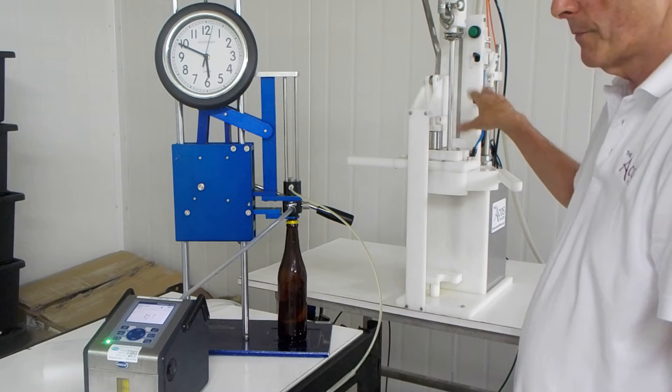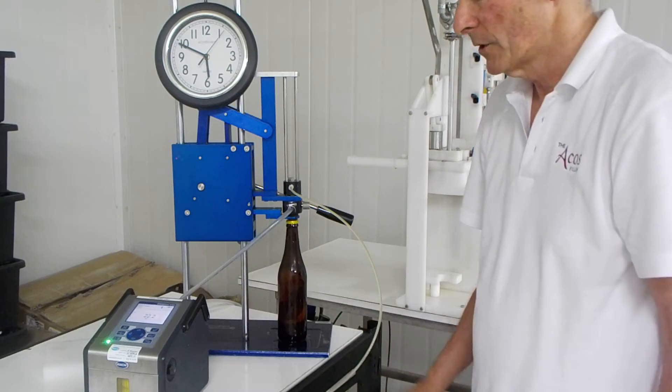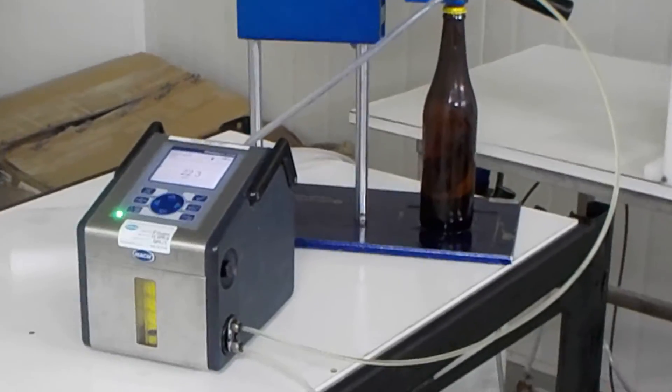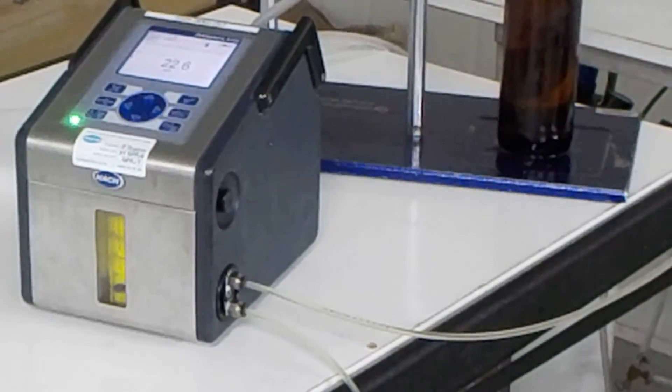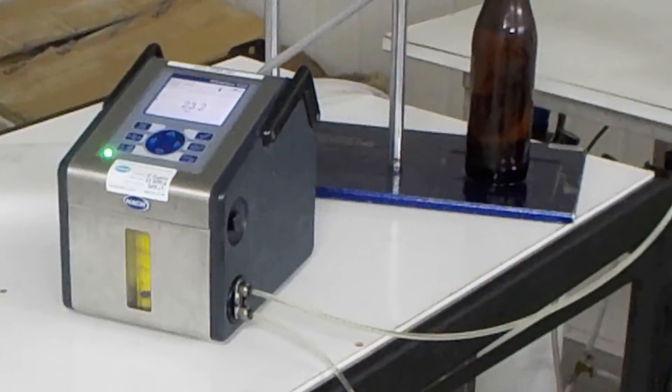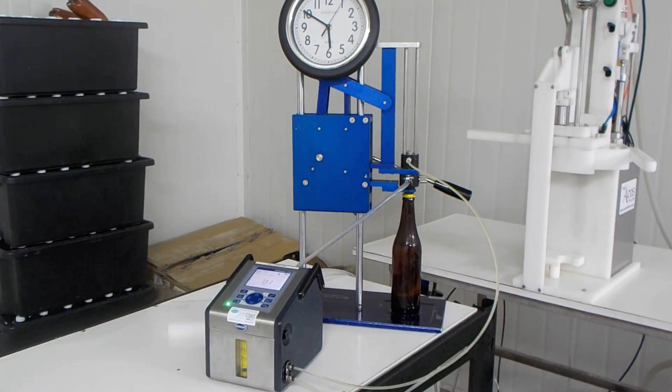This time I only did it without the purge and it's currently running at about 22.2. I'll zoom in and make sure the camera can see this. It's reading 22.7 to 22.9 parts per billion. If it was high, it would be climbing really fast. 23 parts per billion. 22.7. It's somewhere around about that — it's going to stabilize somewhere around there. 23.1. 22.8. So that's reasonably stable. I'll zoom back out to let the camera read it properly. Hopefully that's reading it. And we'll turn that off.